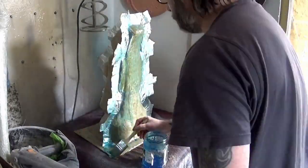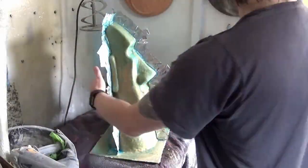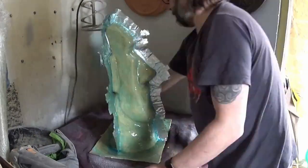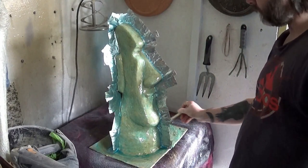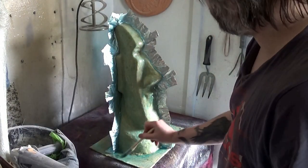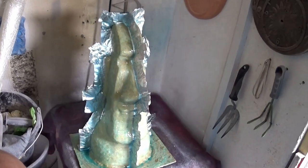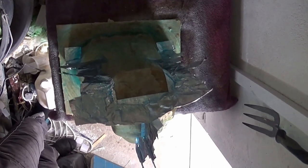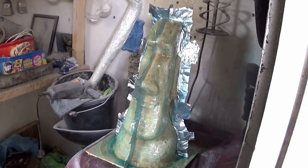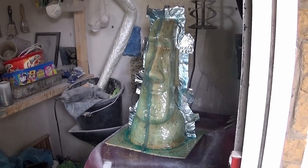This video is pretty straightforward: make sure you get your wax first and PVA second. I used to get mixed up and put the PVA first and the wax second, but it's wax first, PVA second. So there we are — that's the end of this stage for our three piece mother mold for this Easter Island head. In the second part we'll be applying the fiberglass to make the fiberglass mother mold.